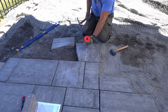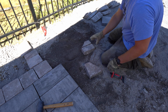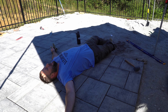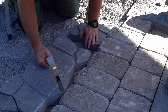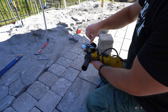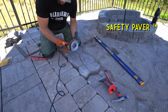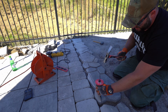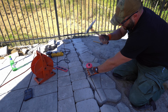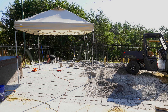On the bright side, I picked up this cool rock hammer and chisel and learned that I kind of love it, even though I'm not great at it. At this point in the process, I was just realizing I'm not even a quarter of the way done. But these stones ain't gonna lay themselves, and for this portion, the chisel just wasn't gonna cut it. So I put a diamond blade on my angle grinder and got to work cutting the first straight edge. I've never cut stone with a grinder like this, so I strategically placed a safety paver just in case. It made nice clean lines and was the last hurdle for me to lay the rest of the pavers.